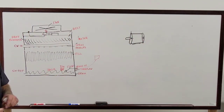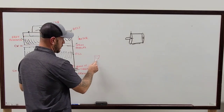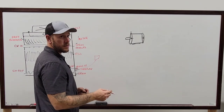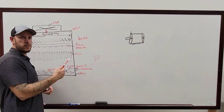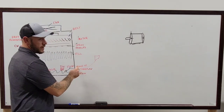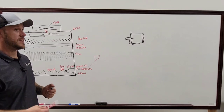But all of them obviously do something different depending on what application you're using. And the controller that we normally use, all it has is a spot for your 120 volt to feed your solenoid, and then it has a spot for the sensors to run back into the same control box. But in that control box, some of them have a speaker in there to where when it reaches high alarm, it throws the speaker and goes into high alarm. Some of them have it to where when it senses that it's on high alarm, it actually kills the 120 to the makeup valve. There's so many different ones. There's all kinds of different applications that you can do with it. It just depends on what's in the tower.